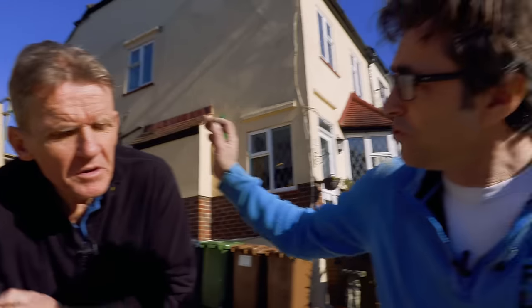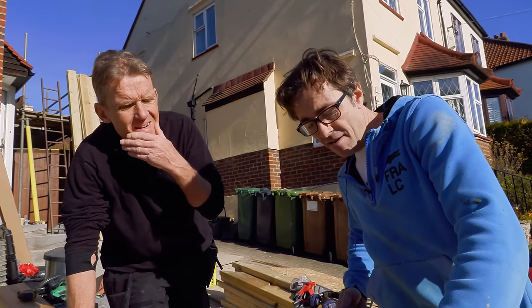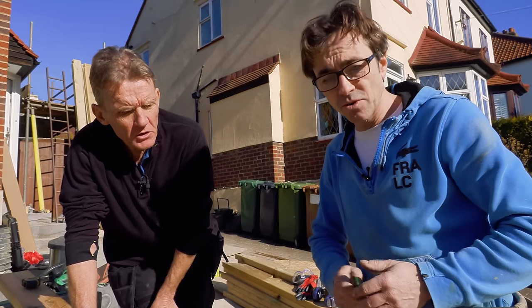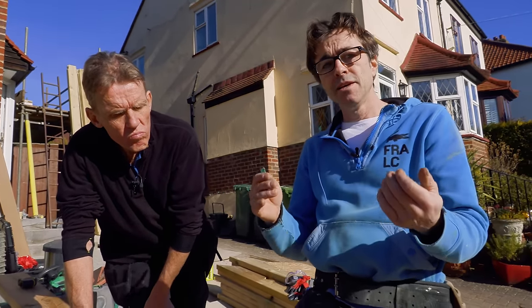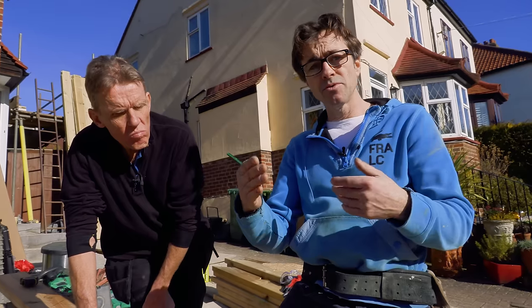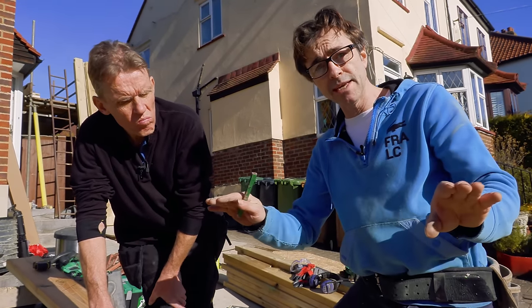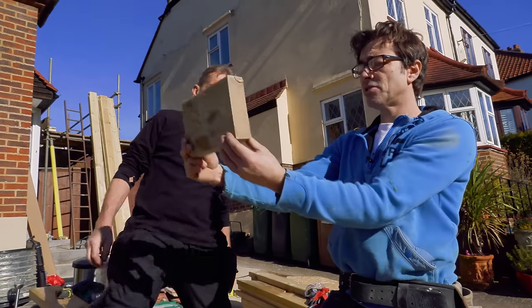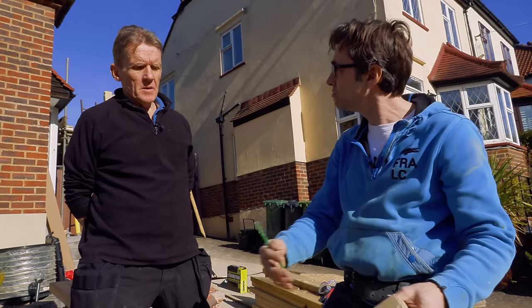It's actually a ridge board, which we're going to bottom-fix through the top flange of the steel — drill the holes and bolt it up. But we'll build all the roof on first, because the steels are never perfectly parallel — they're always a few mil out. This way, the ridge will land on the steel, run in and out, and then we'll bolt it up afterwards and attach all the roof together.